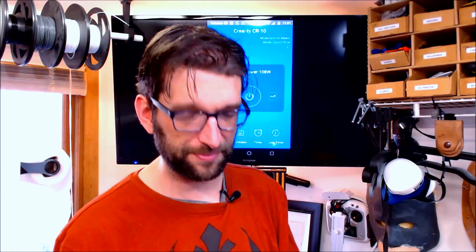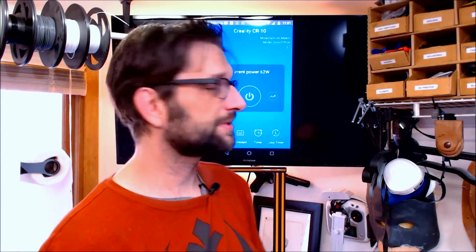We'll take a look at that in another video. One of the coolest features of the Sonoff is the fact that there's an app on my phone that shows me in real time exactly how much electricity I'm using as the printer's running. Right now with the CR10 at a bed temperature of 60 degrees, nozzle at 205, and an average printing speed of about 45 to 50 millimeters per second, we're averaging anywhere between about 50 watts and 100 to 150 watts most of the time.